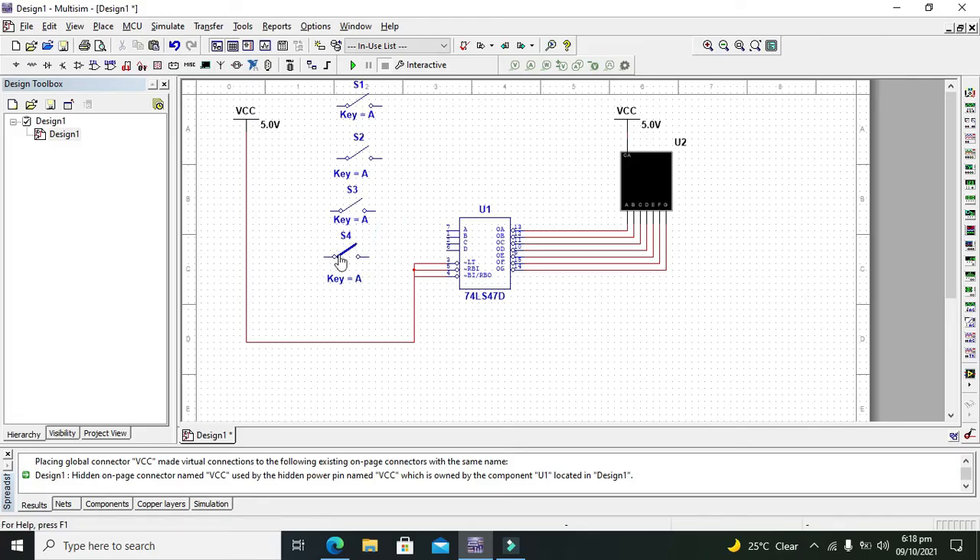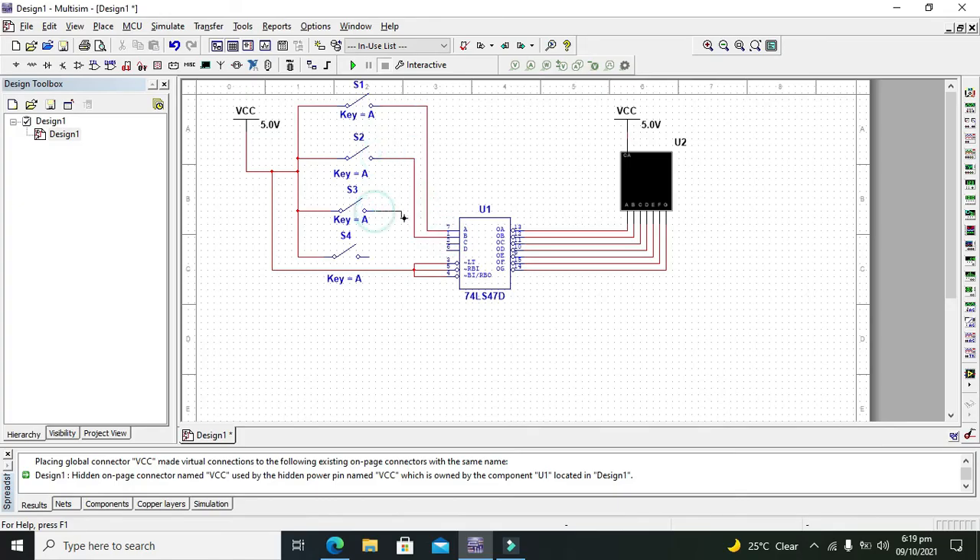We arrange them properly so we can see them clearly. Only the left side of the pins must be connected with each other and also with VCC. Now all the left side pins are connected with VCC, and the right side outputs must go to the DIP switches, so we will get binary data in with the help of these switches as digital input.